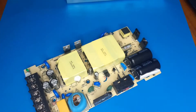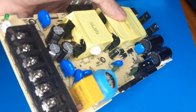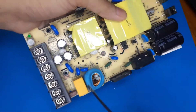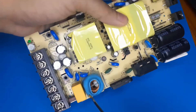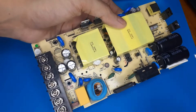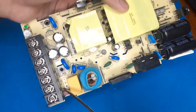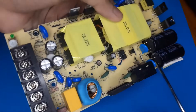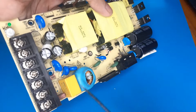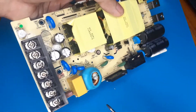The model number on the MOVs is 241K 10E - these are something like 200 volt withstanding. I'm not sure why they omitted the input MOV; it could be a design choice. It doesn't look like a cost-cutting choice because everything else seems reasonable - they wouldn't just remove one component from the BOM purely for cost.